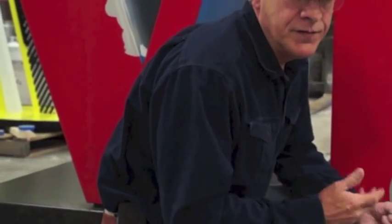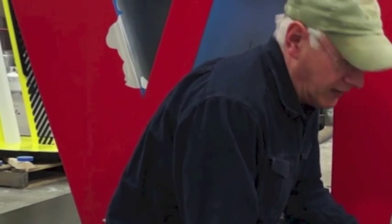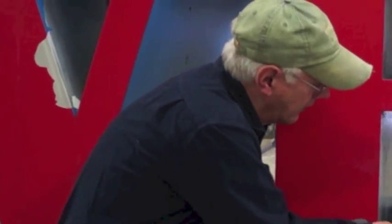Okay, this type of paint system would not be approvable by the U.S. Coast Guard, would not be approvable by Lloyd's Registry of Shipping or the American Yacht and Boating Council. There is a very specific way to paint aluminum to those codes, and it's by using that greenish primer first, sealing primer second, and a top coat that survives in a marine environment. But this is not being done on artwork, has not been done on artwork since the explosion of large outdoor public art way back in the 1960s. So we're seeing, as a company, a very large number of aluminum pieces coming back to us with this very same problem.